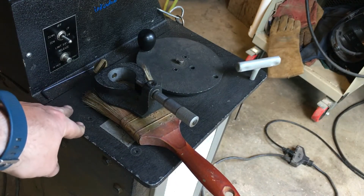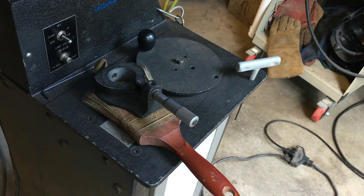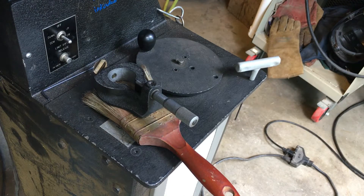We've got a crazy project today — a guy brought in a CB750 cylinder head. When I got it, the standard bore measured 2.399 inches, or essentially 2.4. What we need, because of the pistons they're going to use — and they say standard on them too, which is crazy — is 2.580. That's a lot to take out.